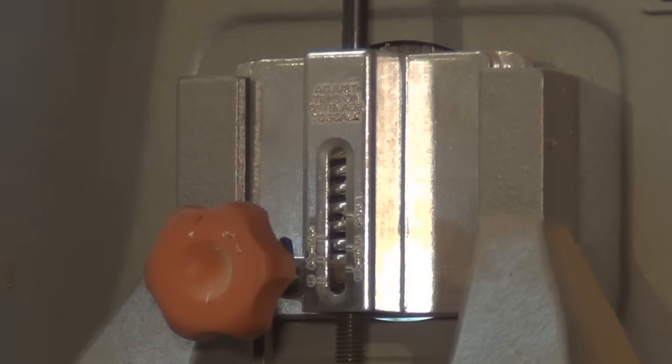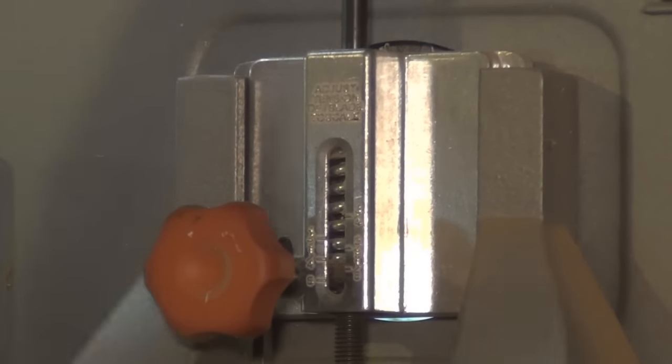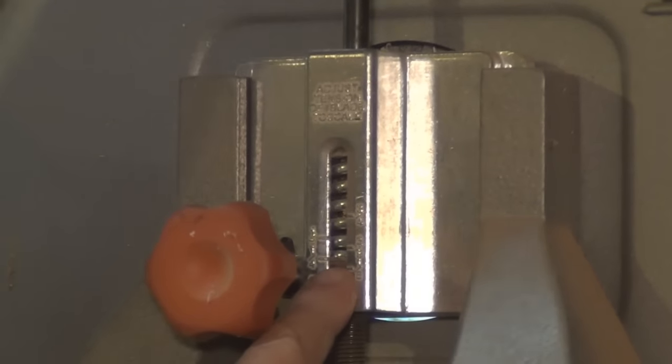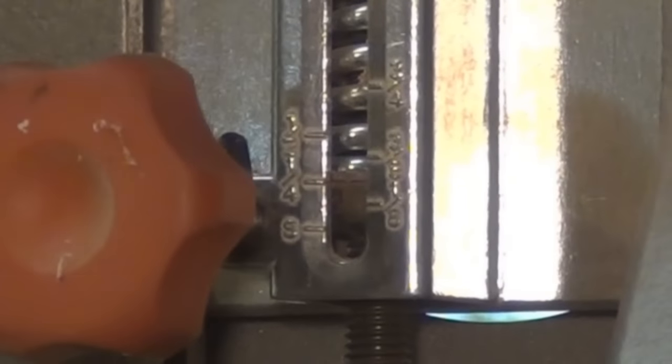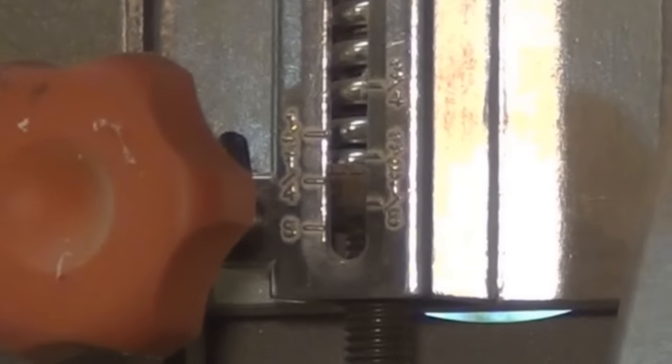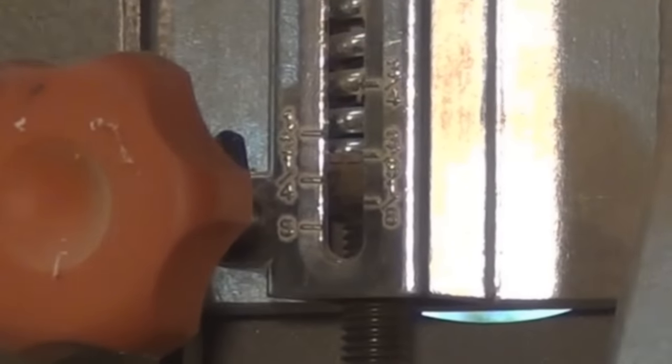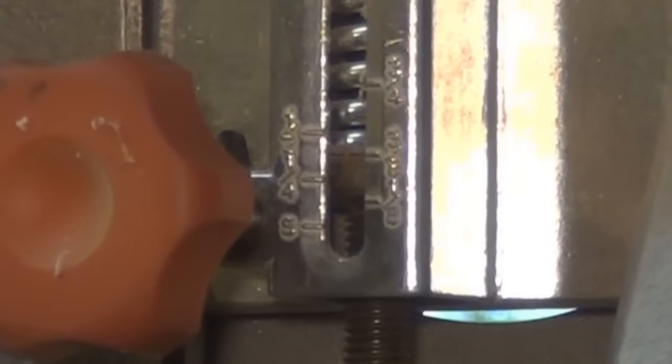This is the blade tensioning guide on my saw. Technically, since I've got a quarter inch blade, I should be able to bring the little red line right up to where it says a quarter inch, and I'll have the proper tension for that blade. These are notoriously underscaled. I'm going to take this one up to at least the 3/8 or half inch tension. Too much and I will potentially break the weld on the blade, but when I do this I don't break the weld and I get a better cut.